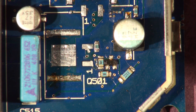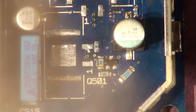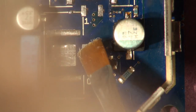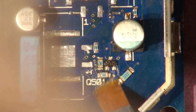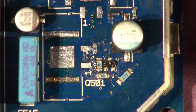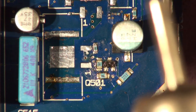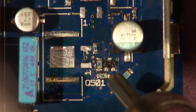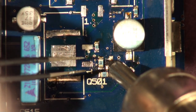We're going to remove some of these components because they are faulty. I've just metered them and they don't read right — one of them is reading an odd reading so I've got to take it out of circuit to check it. It's these three here that have got to come out, be tested. We've got the hot air gun on, heating away nicely with a narrow tip and a nicely directed jet of air.